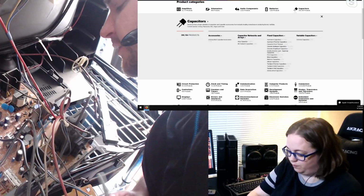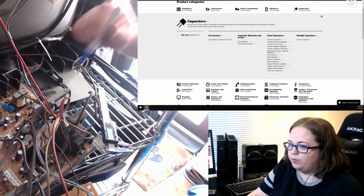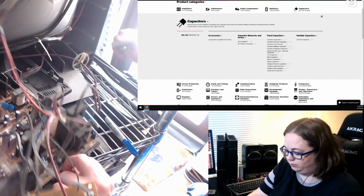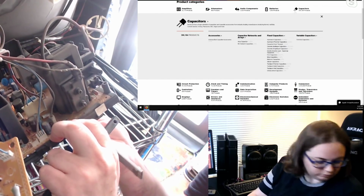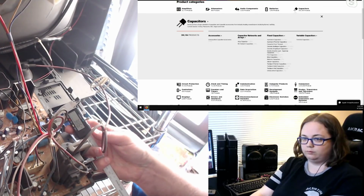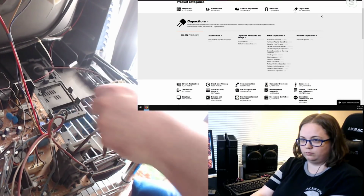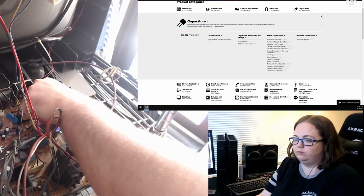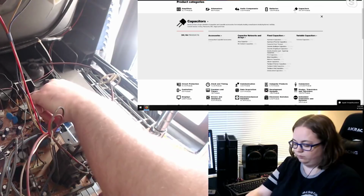1 microfarad, 50 volt. Okay. What was the terminal pitch on the 16 volt one? Oh, yep, sorry. I feel like that one would be smaller. Way smaller, yeah, like 2 millimeter-ish. It could be 4 millimeter. This is one of those spacings where the legs of the capacitors are kind of bent out to the side, so the terminal pitch wouldn't have to match the pitch of the board. Let me try to get the cap itself's pitch. Yeah, about 2 millimeter. Good guess.